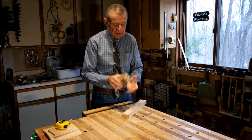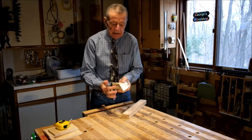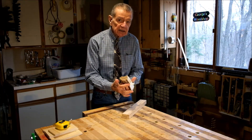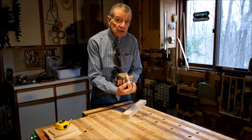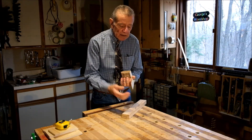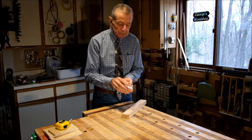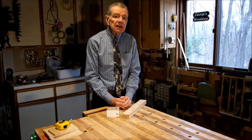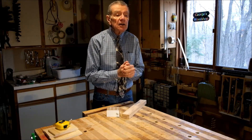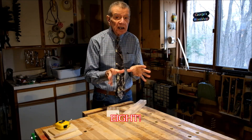Okay, here's the first hint. If you take a closer look at the panels that I have, I get the one-eighth inch resolution by having an extra panel here at the end that's only an eighth of an inch thick. So all of the panels are a quarter of an inch thick, or six millimeters, and then the last one is an eighth of an inch thick, or three millimeters. So that's the first hint: three full inches of capacity with one-eighth inch intervals, done with only nine panels.